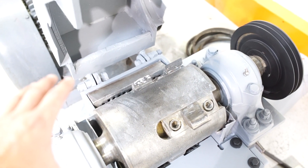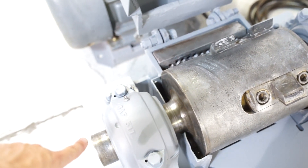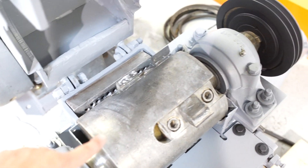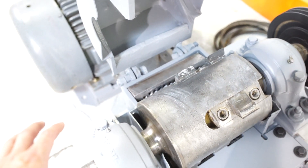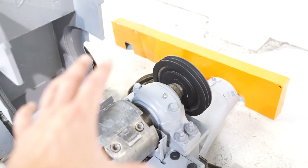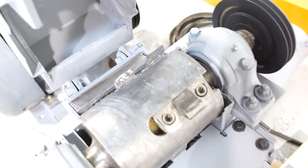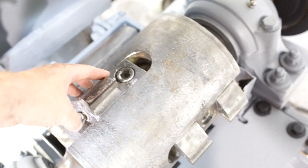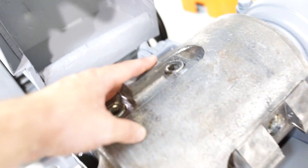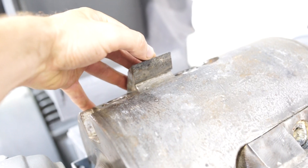You have an eight and a half by eleven and a quarter inch head. The shafts and the head are milled out of one solid piece. So you have these two huge bearing blocks, and you do have your pulley on one side. It does have five holders, and these holders just come right out. Each holder has a two inch brazed-on insert — very easily serviceable.